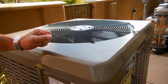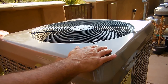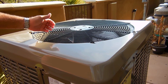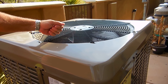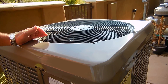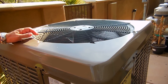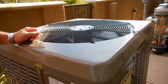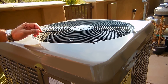What you can do is disconnect power to the unit, unscrew the screws all around the top, and once you do that, this whole piece will be able to lift up and tilt out of the way to the side. Then you can go inside using a garden hose very carefully — you do not want to damage any of the fins with the jet from the hose. Use a shower or misting spray pattern to clean all those coils and wash away accumulated dirt. You can also use a coil cleaner spray available at Lowe's or Home Depot — spray down all the coils, allow it to sit, and then rinse. By doing that, you're going to increase the efficiency of the unit. If the system only has a 14 to 15 degree differential, by cleaning the coils you could probably gain an extra degree or two.